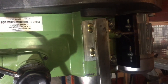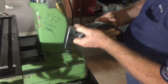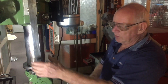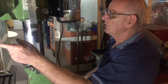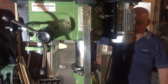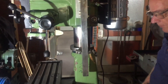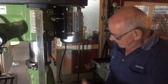We'll make these within an easy packaging size, and people can buy the standard bar to use locally. So whether it's imperial or metric, it won't matter because we've got the adjustment here. We see that it works quite well, giving us an accurate drop as we roll it down, bringing us up towards the dovetail. It will never be a dovetail top, but what it does mean is if we've got to move from one point to another to get more throat depth on the same job, we're not going to have to worry about it being in the same vertical plane. Looks good.